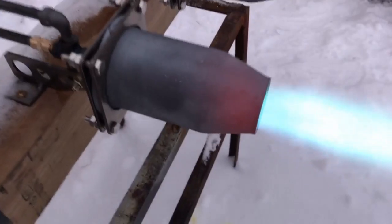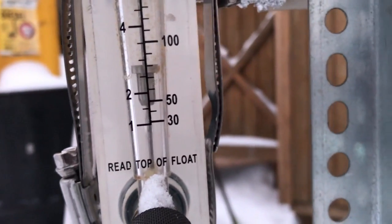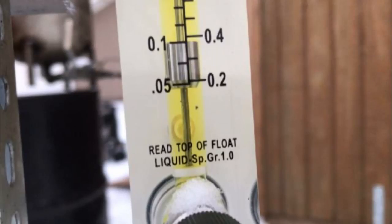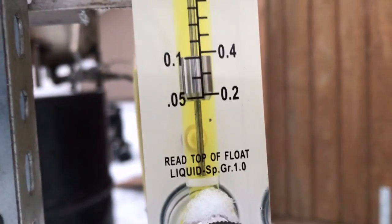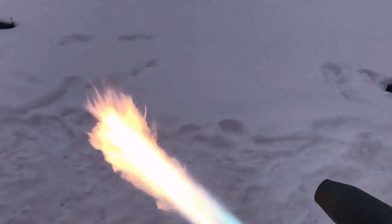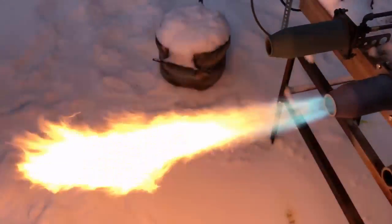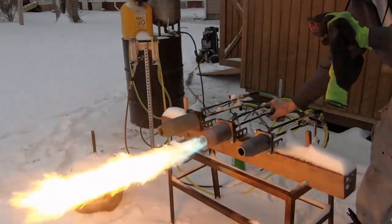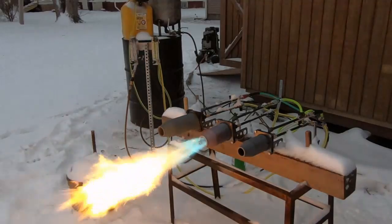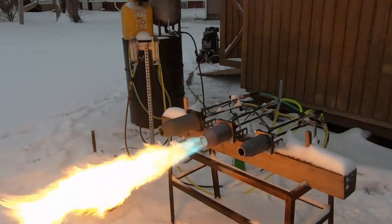You can see that thing is just burning white hot on the inside there, and we're in blowing freezing cold wind right now. Right there we are hovering right around 80 liters a minute or so, and at about 230 to 240 kilowatts. The amount of hot air coming off this thing is incredible. Now here's the high fire setting. As you can see the wind is definitely mucking up the flame a little bit, but very powerful flame coming out of this thing. So if you get in a situation where you just need a lot of power, because it's a high velocity flame, you can see that it's not headed up into the boiler bottom there burning up your shields.